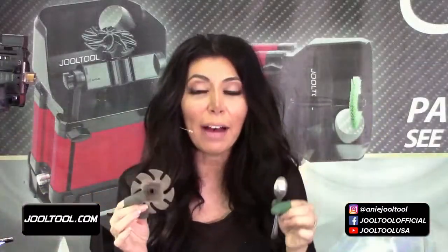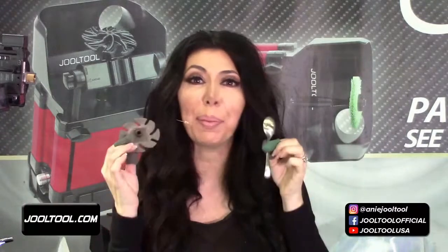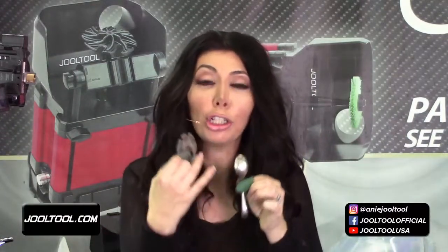If you have a really bad pit and the metal is hard just like this, and it's taking a while to burnish it, you might grab the purple, like 120 grit, and lightly go over that pit, but while moving, not standing in one spot. You don't want to create a flat spot because this is a dome. Just in that one particular area.